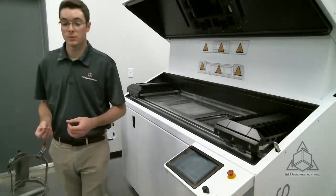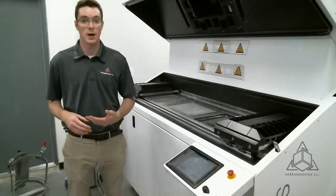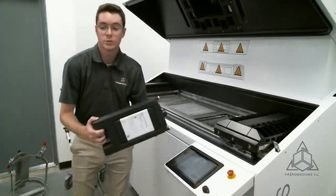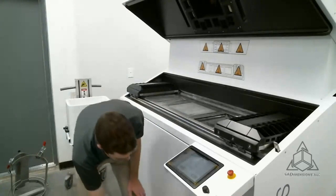Here we have the build box, which I'll talk about shortly. This machine prints in a 70-30 mix — 70% used powder and 30% virgin powder. So you can reclaim a lot of this powder, get consistent results regardless, and it makes the machine really economical. Underneath this screen is where the fluid goes. The fluid cartridges look almost exactly like PolyJet cartridges. There are two spots: one cartridge has the fluid, the other is for waste.